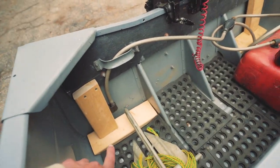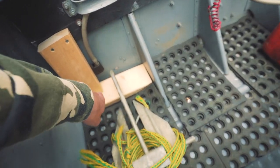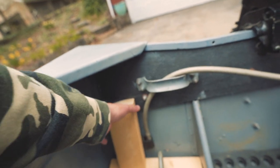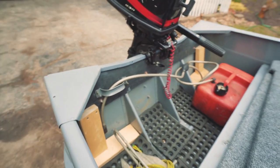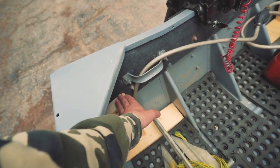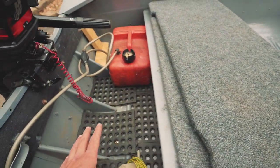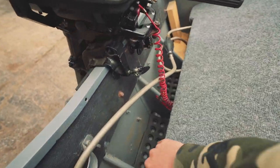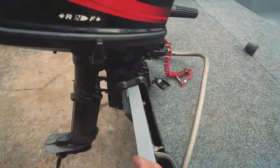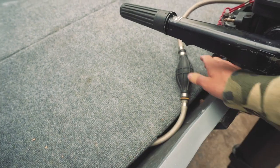In the rear, we did a little bit of framework - literally the lightest way I could think of doing it. My dad and I cut two-by-fours to the length of the back of the boat and ran a second support into the transom. This allows us to take the piece of three-quarter inch plywood, support it back there so you can stand on it, and we left about an inch and a half of bench so the rear piece could be supported. We also left a decent gap in the back so we could run wires or the gas hose through there.